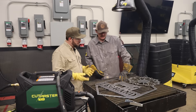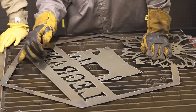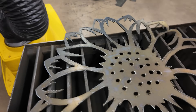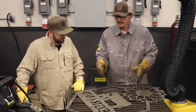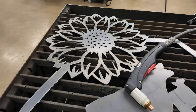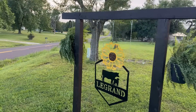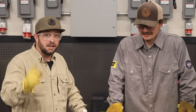You whipped through this thing really fast — let's flip it over and see the backside. You're still going to have dross; that's almost impossible to avoid. Here you can see the travel speed was perfect. One thing to note: that consumable went through the whole job on one set. When you have a well-tuned machine with good clean air, you get good results. A lot of this dross would come off if we just banged the sign, but with these flimsy components you'd end up bending it. So I get a wire wheel — safety glasses on, because those are projectiles — and then go back with a series of flap discs to clean it up, flip it, clean the front, and finish it out. You can find my work on Instagram, TikTok, and YouTube as Grand Metal Works, and on Facebook as LMW The Grand Metal Works.